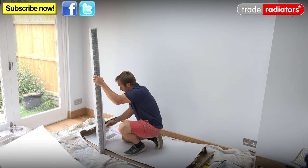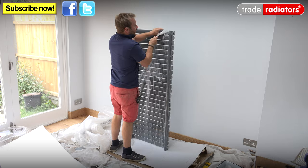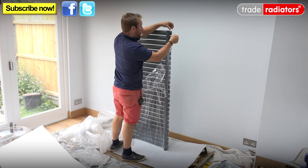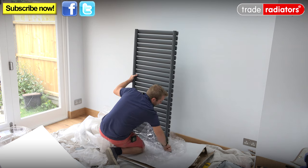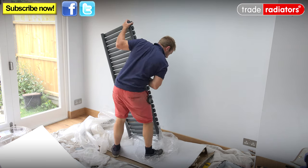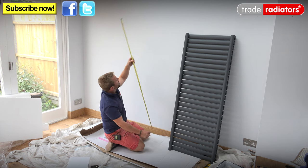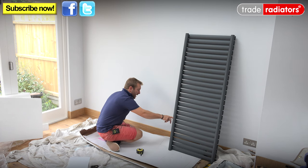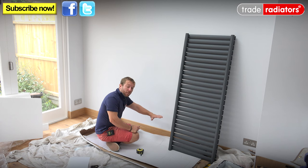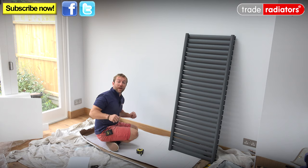We found our brackets on the back just down here. Look at how well packaged this lot is — when you order a radiator the chances of anything bad happening on the way are really unlikely because they are so well packaged. We measure the radiator and divide that measurement by two — on this one that's 75mm. Now we know how far we need to bring each pipe out. We're just going to get our two radiator pipes marked in along here.